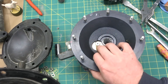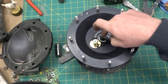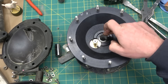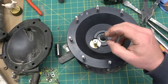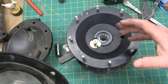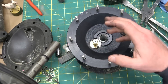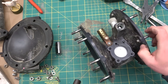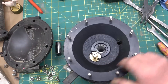And that's just the designation in the nomenclature as written down by the product number. In here we have some Delrin sleeving. That's really good for dimensional stability in wet atmospheres because these kind of hydrocarbon long-chain molecules do pick up moisture in the air and they swell — you wouldn't want this to swell because it's quite a tight fit. So here's what's going on: we have a pilot valve and then we have the main valve. The main valve is what shuttles air over one side through these T-drillings.